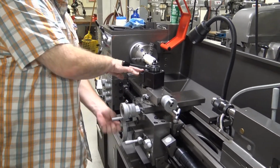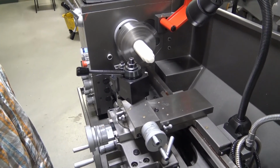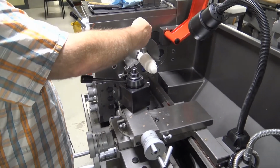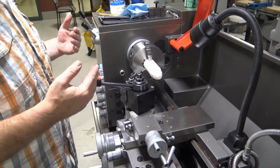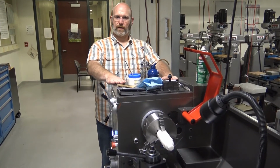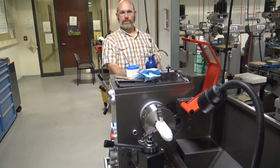I have mounted my tool into the tool post, and I'm going to turn the spindle on clockwise. Clockwise is defined as the top of the spindle coming towards you. That definition generates from being on the outside of the machine on the motor end, which is where the headstock is. So the outside of the machine on the motor end, looking down the spindle clockwise.